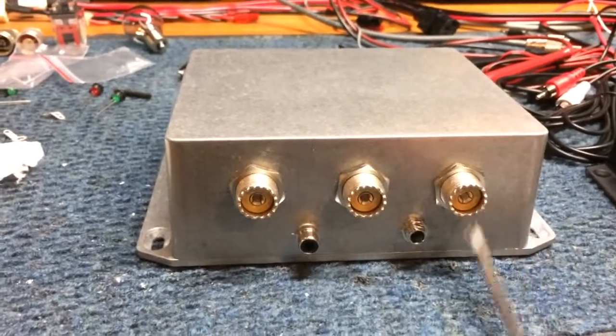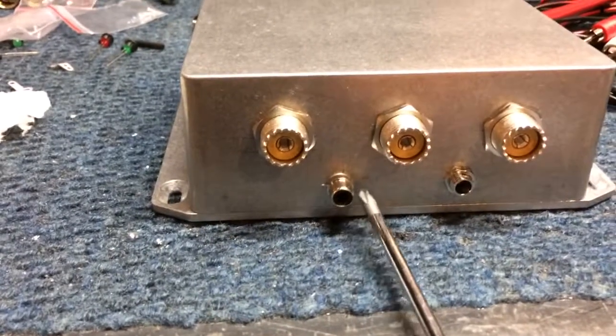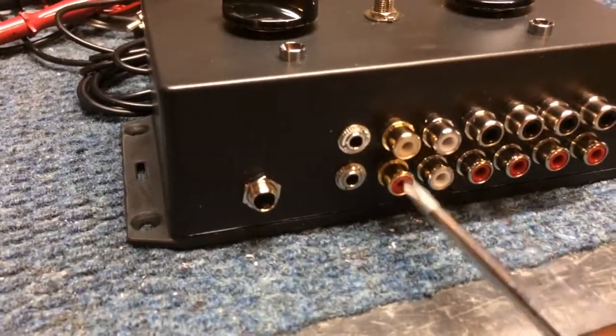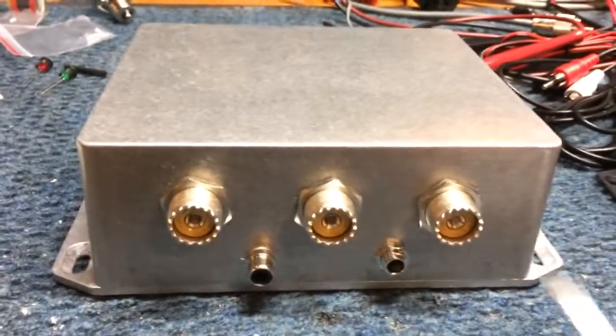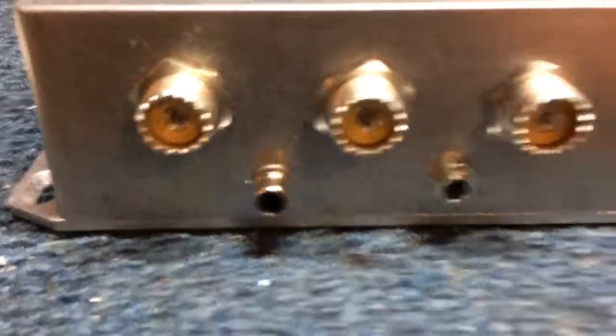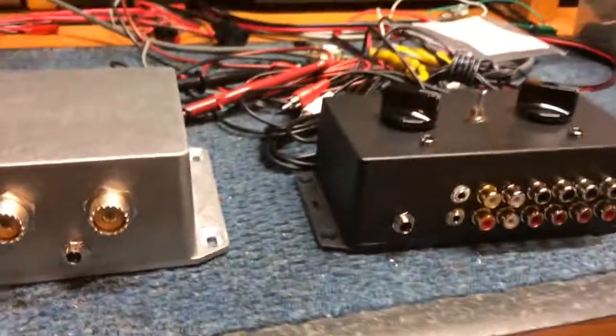We swept it — it's good for at least 70 dB isolation at HF easily. The relay control connection is a standard RCA jack. All you need is an RCA cable from here over to one of the two gold jacks on the main box, and when your radio keys the amplifier, it will switch this relay box as needed. The DC power jack uses a standard 5.5mm outer diameter, 2.5mm inner diameter barrel connector — both boxes use the same type.